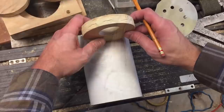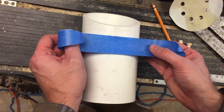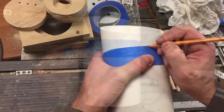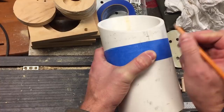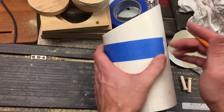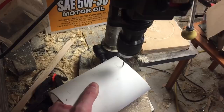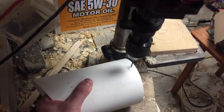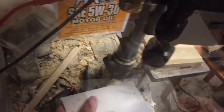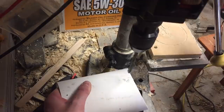Our doors are going to be inset — we're going to have a little overhang. So we need to mark the distance that that's going to sit inside the pipe. I'm using some blue tape to create a straight edge that goes all around the circumference. I'm going to find a point that is halfway between the front edge and the tape — this is the halfway point on the thickness of whatever ply you happen to be using. I'm using three-quarter inch, so this would be three-eighths. I go about a third of the way around the pipe, make another mark, and do that on both the front and back side. We're going to have three holes in each location. I'm going to drill pilot holes so that we don't split the pipe once we put some wood screws in there. I'm going to use a bullnose drill bit — this will allow me to create a countersink and inset the head of the screw into the pipe such that it's smooth with the outer surface.